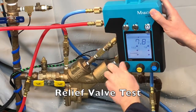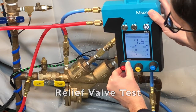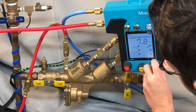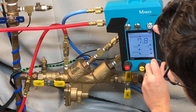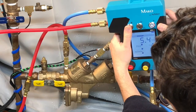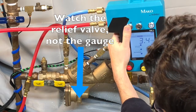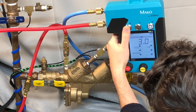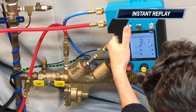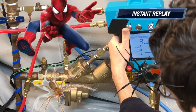Open the high side valve approximately one turn. Slowly open the low side valve — when opening the low side control knob, turn it no more than one quarter of a turn. Place your thumb in position over the capture button. Watch the relief valve and press the capture button at the first discharge of water. Use your eyes rather than your spare hand — no need to subject yourself to bites from spiders or scorpions.